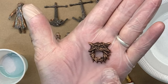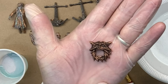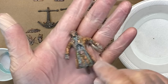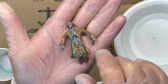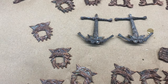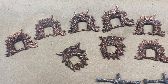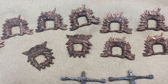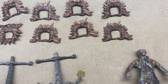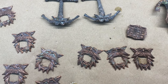In reality I wanted to use the ammonia bath — fuming it to get a green patina. Some of these did get some of that; you can see on this particular character it has a little of that aqua patina. Here's the completed group that I just finished, and I like the look of it. I like the little hint of copper and the darkness that goes with it. They're still a little damp from the water rinse, but I think that gives you a pretty good idea of what it's going to look like.